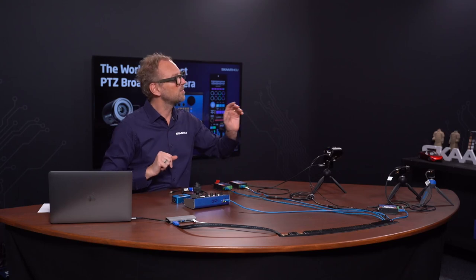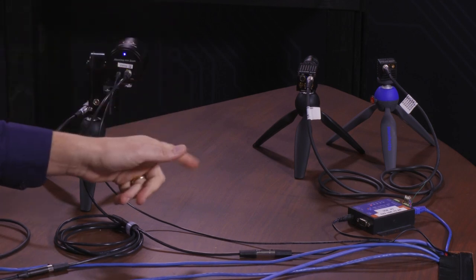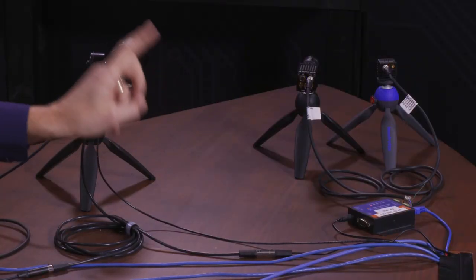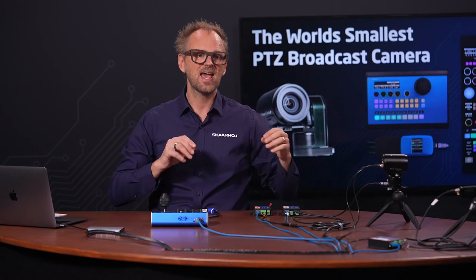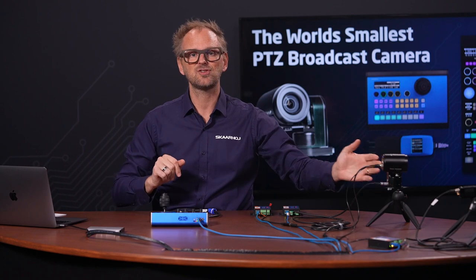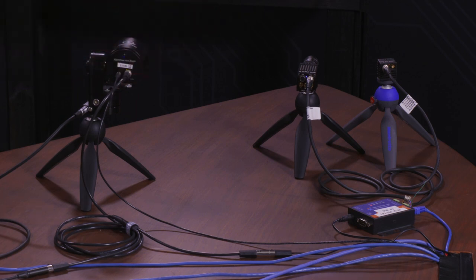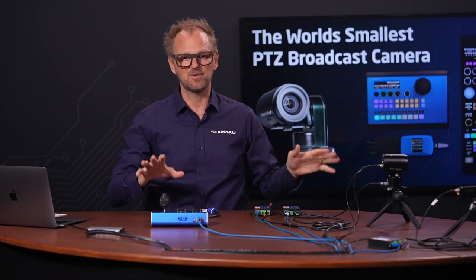Later in this video we'll look at two other DreamChip cameras in the far corner, also connected to a similar serial converter on the network. This one converter powers and controls two cameras, because all of these units have a so-called bus ID — an identification on the serial bus. So one has number one, another has number three, and those over there have number two and number one. This allows us to control multiple serial cameras on the same serial converter.